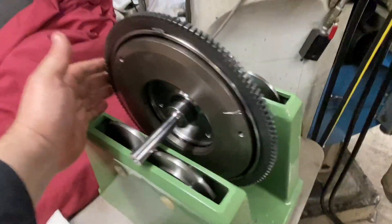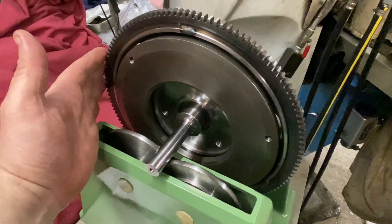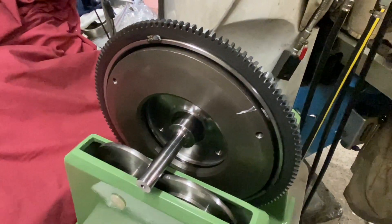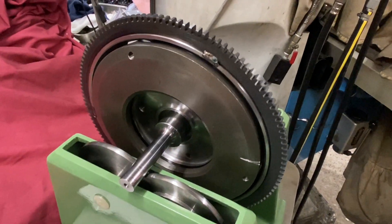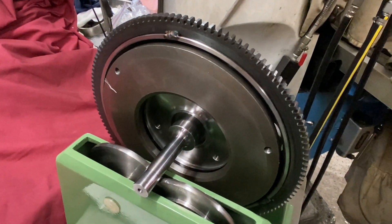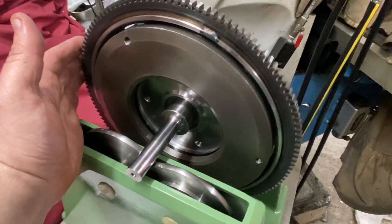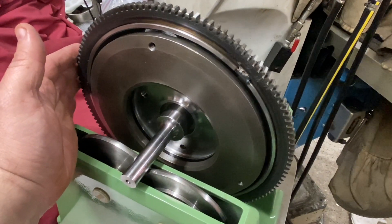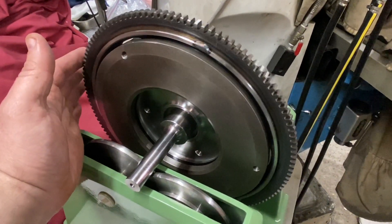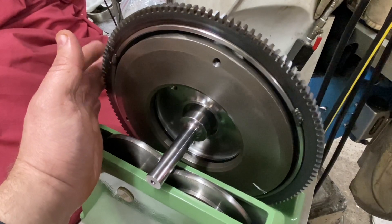What I've done now is assembled the flywheel — it's got its cover on, the bolts are in and tight, and the back plate is on, having already centered that. What we've now got is the residual balance of the rest of the mechanism. That's the heavy spot — I've already marked it. You can see when I let that go, it falls down. We go to the other side, let it go, and it falls down that side. So now we need to drill that back plate into balance. You'll also notice I don't fit the friction disc when balancing, purely because the friction disc is free to rotate on the primary gear — it's not part of the flywheel assembly in terms of being locked together. It's rotating around the axis of the primary gear with quite a large clearance, so as it's a small part, I class it as insignificant and I don't balance it.